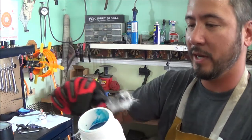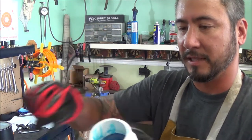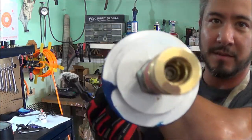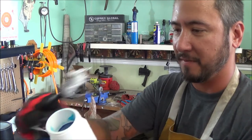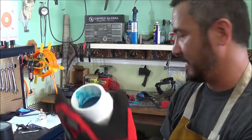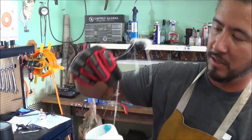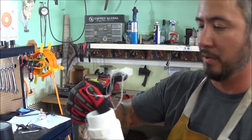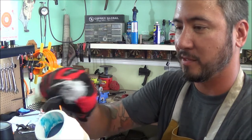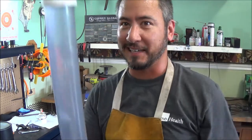So it's a nice quick change out, especially with those little coupler release things. I don't even know what they're called for the air tools. Since I put those on both ends, one on the bottom, one on the top, then that definitely makes it way easier to get in and out, because previously I had just the hose going directly to a screw nipple. So it made it a lot harder because I had to basically twist up the hose so when I screwed it back in, it would untwist the hose. This way, just click, click, and it's out.